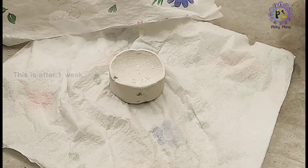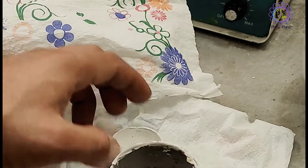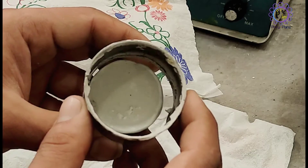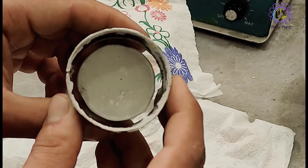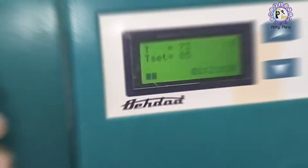After 24 hours and a little hardening, the mold has been removed, because the mold prevents the crucible from drying uniformly and can cause growing cracks. You may notice some reduction in size, but that's okay. It takes about one week for the crucible to dry completely.